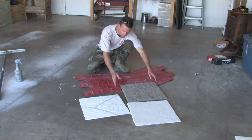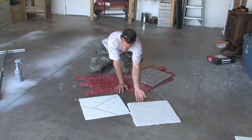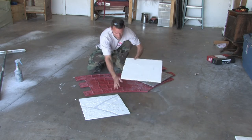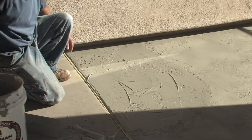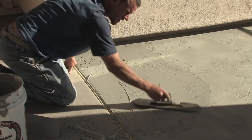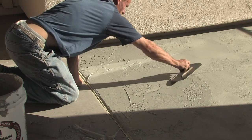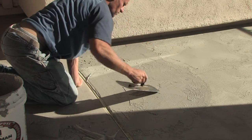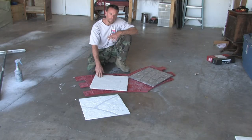There's another way of making it a little easier or more cost effective to stamp — you can use a trowel. So instead of stamping with an Italian slate stamp, which uses more material and is more costly, you can get the texture of a slate from your trowel. That takes a little practice and trial and error, but you can get your texture and then do a light sand on it, and it makes it look like slate or rock.